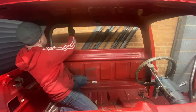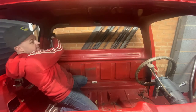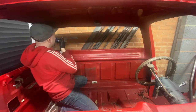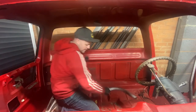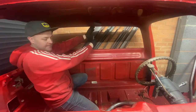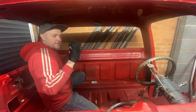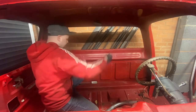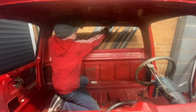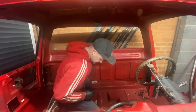So into your corner, get it straight, just back off a little bit, because obviously you're not coming down as a 90, you're coming down as a 70, what did I say it was, 71. So again, pen this bit here, and we're going to measure across the two. So you know that your bend's going to start from the centre of the pipe. You'd have a centre marking, and you would use this calculation to work out your first straight in your bar, and then you're bending away from that. So the way you do that on your bar is get this calculation here, which is 975. You just put that down on there.